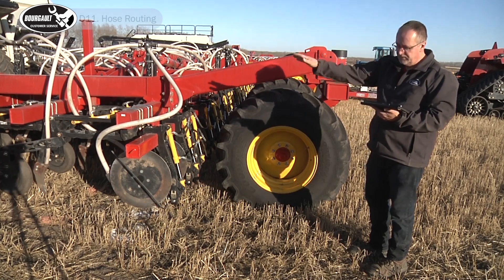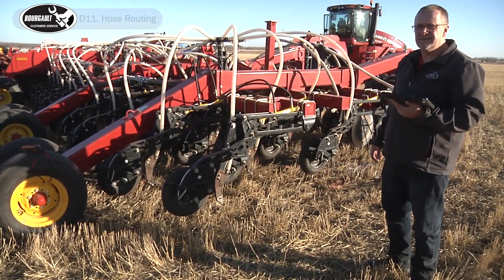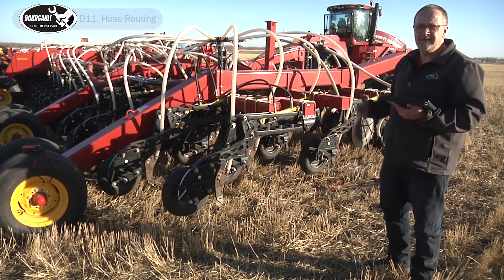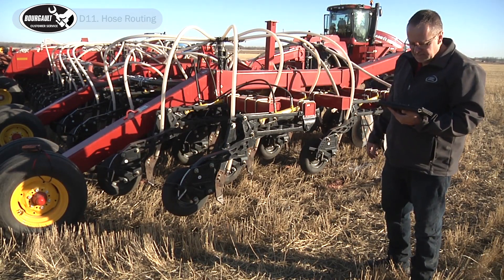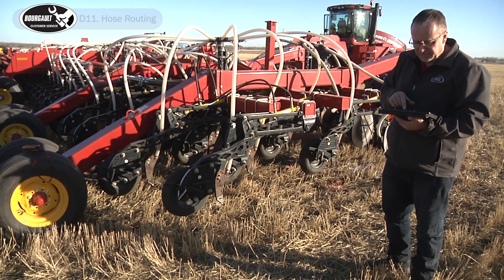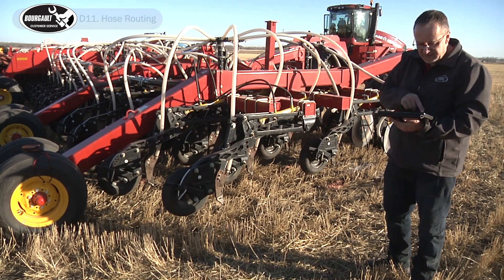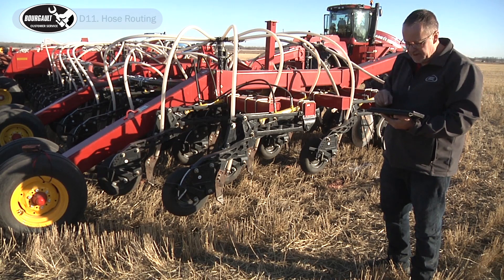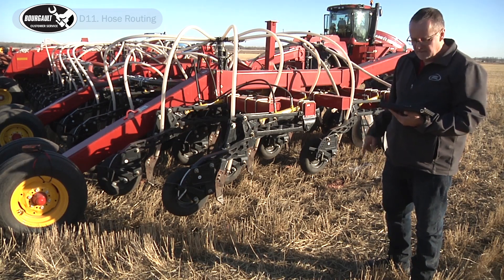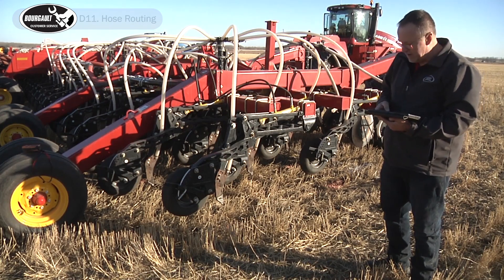And we'll move to the seed side of the tank. Now to check our seed side runs — again it's section one through eight, left through right. This is an eight port tank, so we're going to turn on our tank clutch for our oats in tank four that's going into the seed run. All of our sections are currently off. Our master is on and our tank four clutch is on.